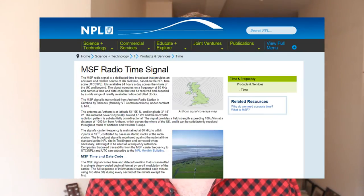But because I'm not massively technical, I'm just using someone else's library, though I do understand the concept of how it works. You have all these zeros and ones coming in — your binary data — and it's measuring the time in between those signals and when they change. So it's saying when the minute starts: you look for this series of four ones and four zeros, I believe it is. And that's when you find out where the minute starts, and then you start recording your binary data coming in.